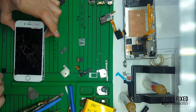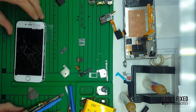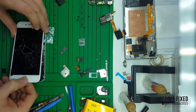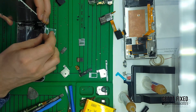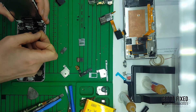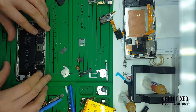The backlight on the main LCD wasn't shorted. So with this phone in particular, it wasn't the fuse — which you'll see in many cases you just short the main fuse. There are three fuses and you just short those and it's all okay. But this one, the diode keeps dying and keeps burning out, creating smoke around it.